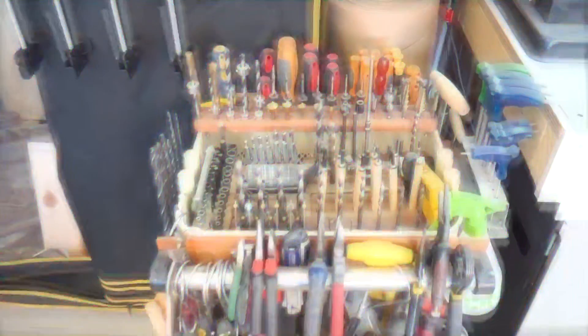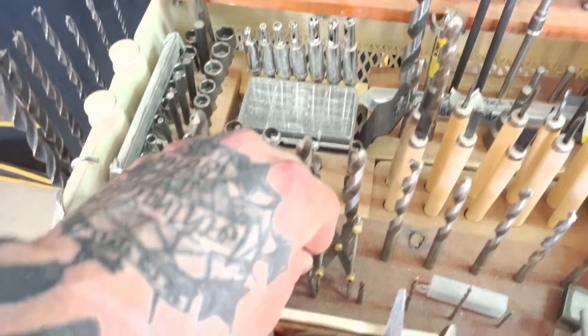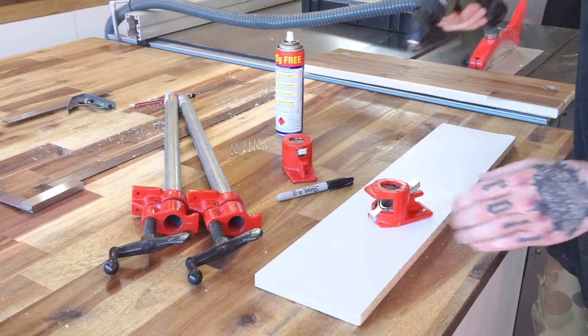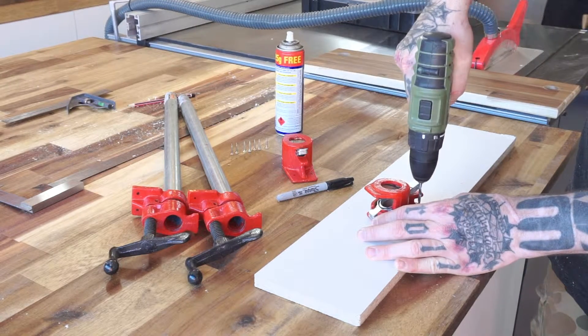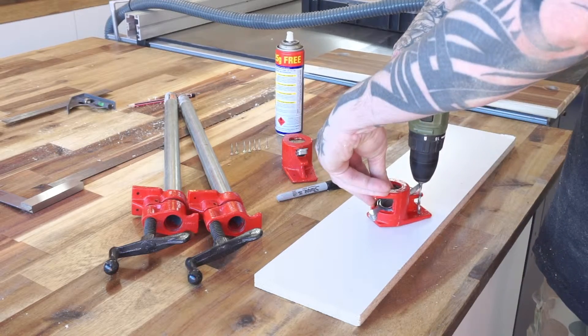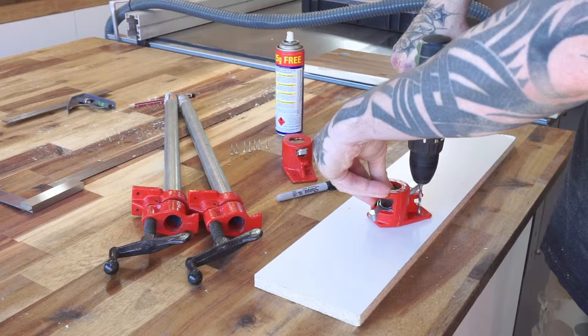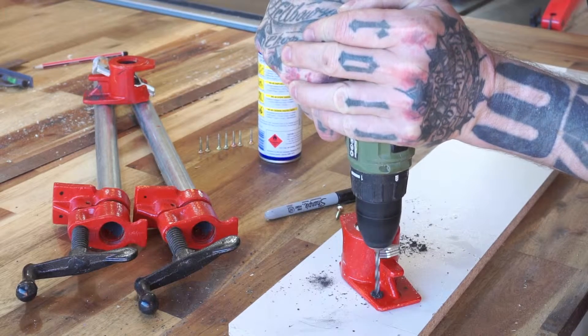This is my shop trolley — I keep all the things I use a lot here in one place. Adam Savage says drawers are where things go to die, and I couldn't agree more. This is the drill bit we're going to use, and it's for metal — which is exactly what we're drilling. If you haven't drilled steel before, make sure you use some metal lubricant like WD-40, otherwise you'll kill your bit and be there all year. It's also very dirty work, so don't do it on your mum's nice tablecloth.